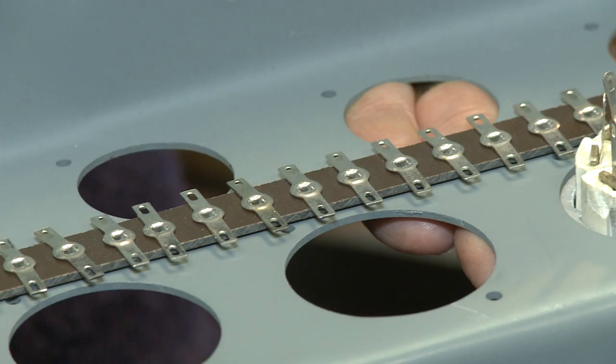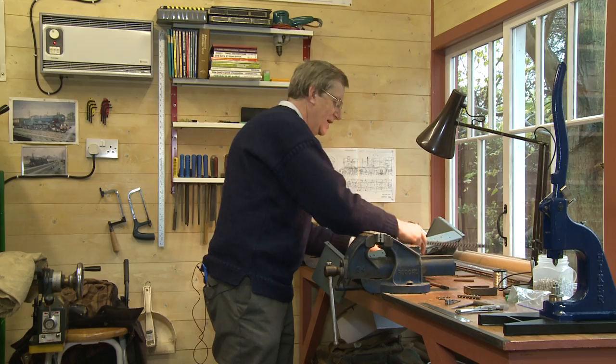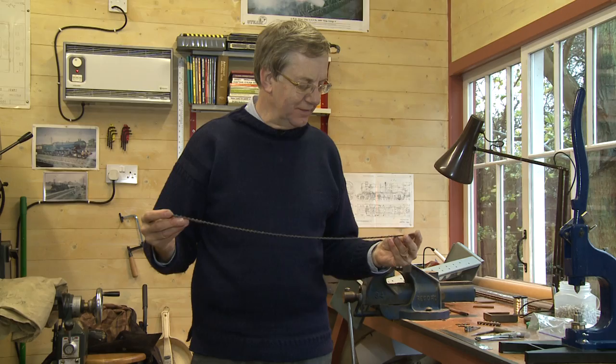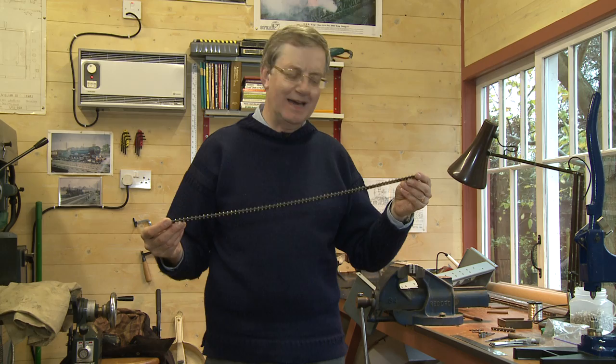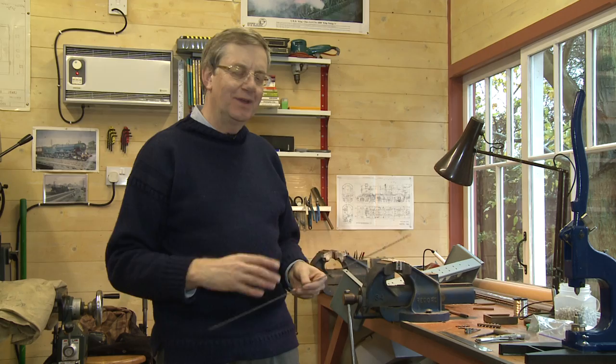It turns out we can still get the valve holders from the same people we buy the valves. The tag strips — there's a company who still makes those, but they only make them in standard lengths or bulk orders. So this is an example of the kind of tag strip we know we're going to need a lot of — two of these more or less for every chassis in EDSAC — so we've had these made commercially. But in other parts of the machine we often need smaller tag strips of rather custom sizes, and so those we've got to make ourselves.